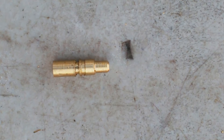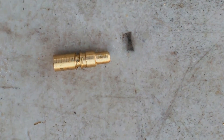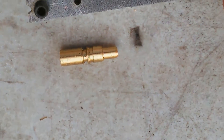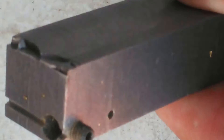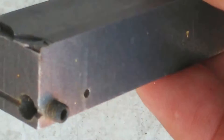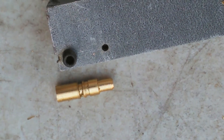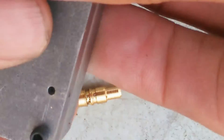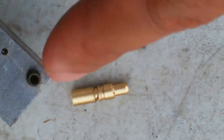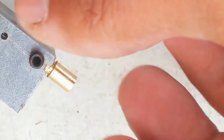I've created a jig to do that. I took a piece of block and machined the ends of it. I'm going to put the piece inside this block — it goes in at that end right there. I also have a slot in this jig, but that's for another video — it's how I cut the end of the piece since it's actually a screw piece. For this video, it's just about drilling into the side of the shank. I use this pin to register where the piece has to be, and I slide the little piece into the block.